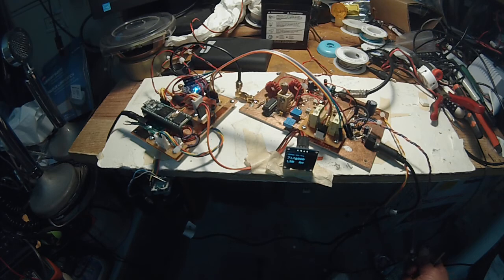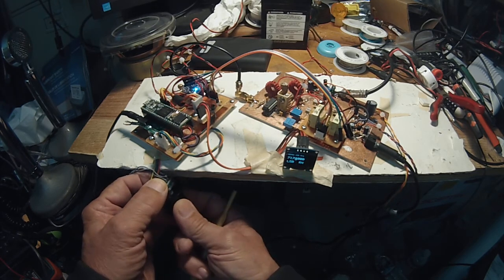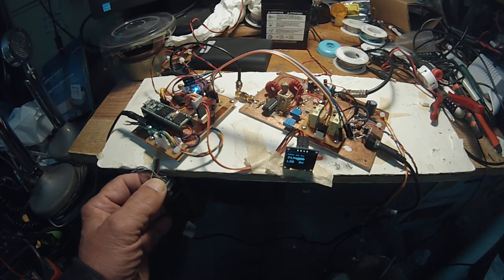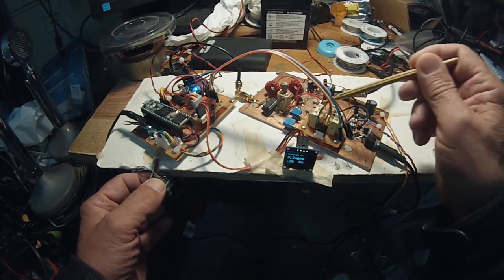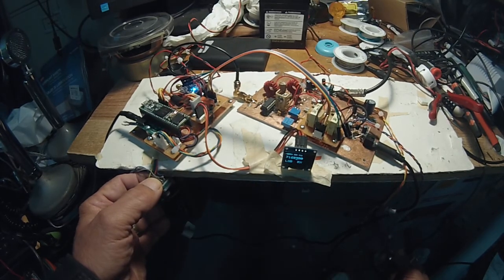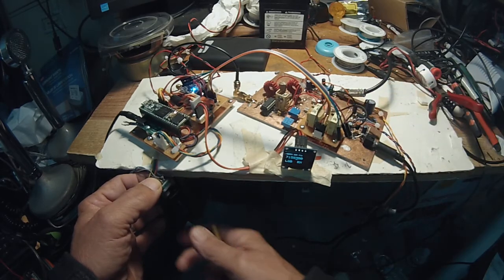You can hear just how that signal popped right out there. Before, between stations, you used to get a burble and a whine. That's all now gone, and the 600 ohm transformers back here cured that problem. You also used to get a terrible clicking as you would tune the encoder. That clicking sound is gone, and the only change was the two 600 ohm to 600 ohm transformers.